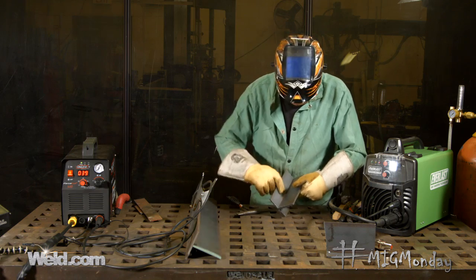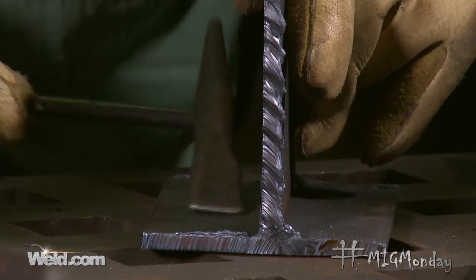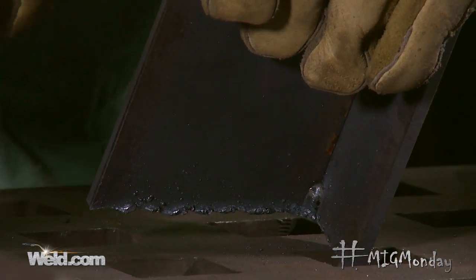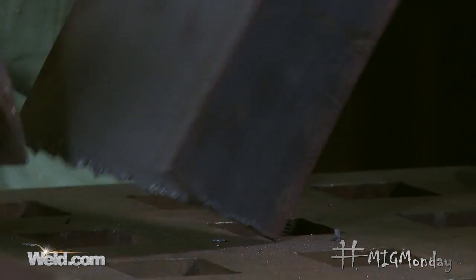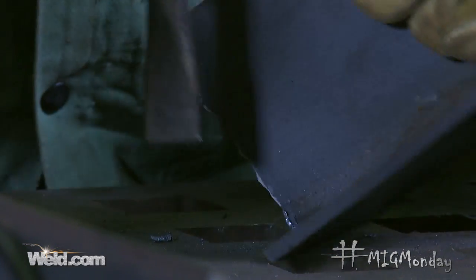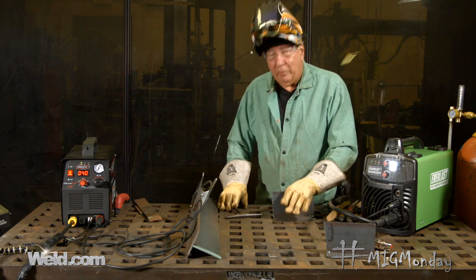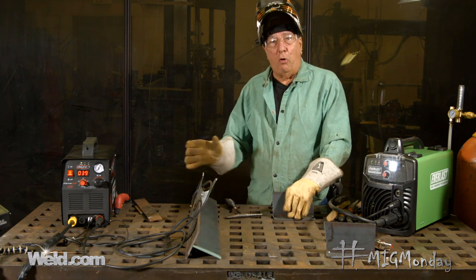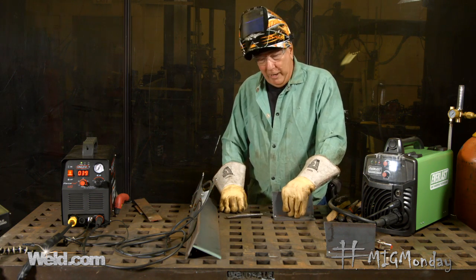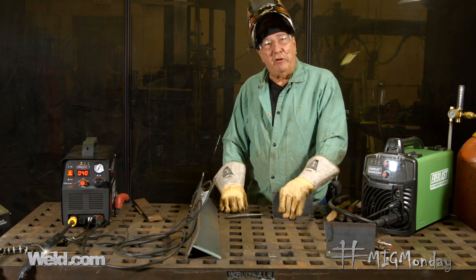One of the things when you do make a cut — what you'll notice is you can see the melted material on the edges of the weld, it's called dross. The beauty of plasma cutting: a couple of hits and that comes right off, so you end up with a pretty nice clean cut ready for whatever usage you're going to do. So that's plasma cutting — it can be a real nice addition to the home workshop, especially if you have a lot of material that you have to cut and piece together. Any questions can be addressed to the forum, and we'll see you next time on MIG Monday.